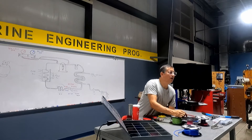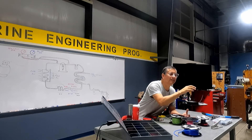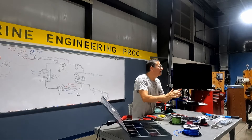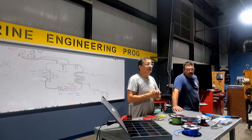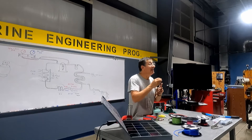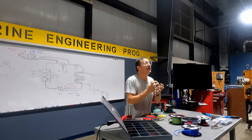Any metal oxide — we are going to study corrosion with more details later. But when any metal is oxidized because oxygen attacks the metal, it produces a powder over the metal. This is oxide of copper, oxide of aluminum. It's the powder you find in the morning. If you leave a piece of iron outside, tomorrow you find the brown powder — iron oxide. The same with aluminum, the same with copper. The problem is this: all metals are excellent conductors — perfect conductors of electricity. But when the metal is covered with oxide, the combination of oxygen and metal produces a powder that is a perfect insulator. The best insulator is the oxide of metals.